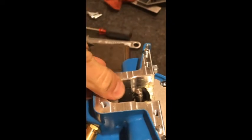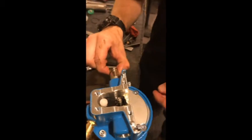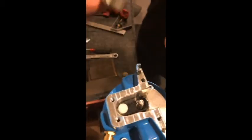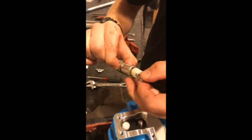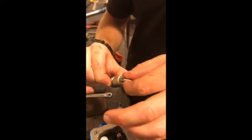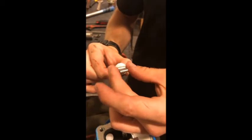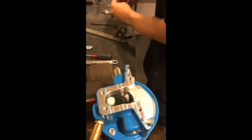We're gonna push this all the way down — actually pull the lower piston down to help us out with that. Pull that down and we're gonna put the side rocker type assembly in place. It's already put together and sitting in the groove. This is actually multiple pieces: there's a spring in there, you have your cap with the groove, and a little rocker that sits in there. You want these to be clean and well greased.